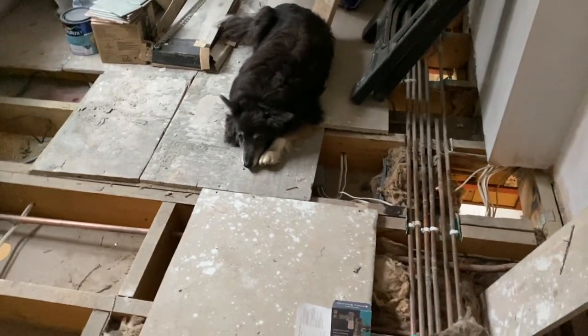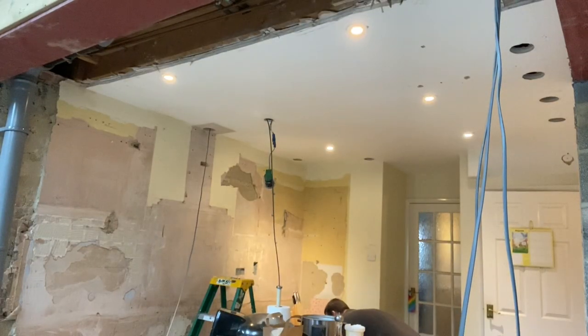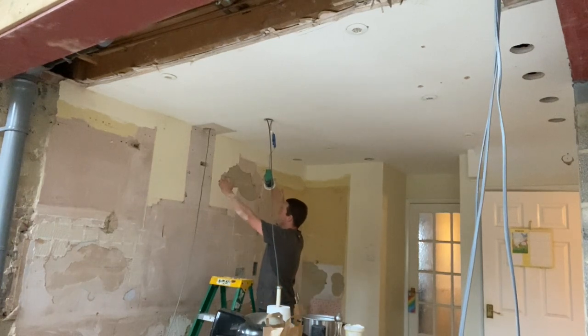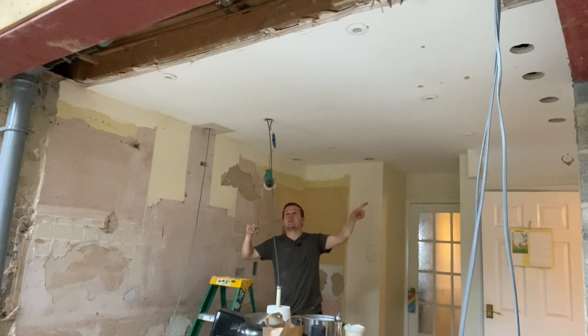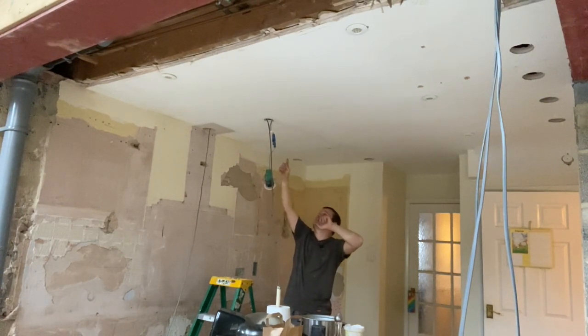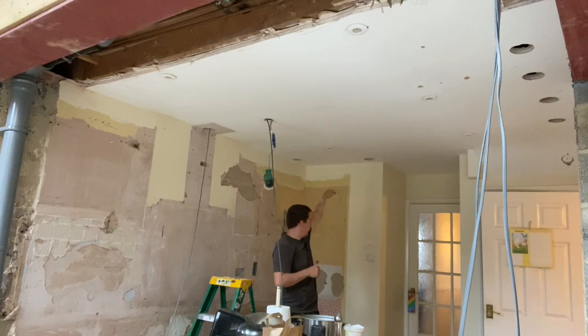This is the floor above. Hello, it's the apprentice — this is Andy, if you remember him from previous videos. I'm working around the temporary kitchen table. I've drilled a hole up here because I need to get cable down for a thousand-wide unit that's going in here with LEDs. The driver will be mounted above the cupboard, so I'll have to chase in to top-of-cupboard height. I've drilled holes — the joists run this way, this is all tiled floor that's staying — so I'm fishing through the existing spotlights across a run of holes I've drilled, then it will drop down to the switch.